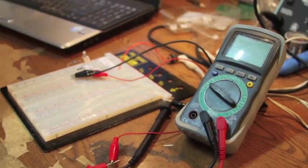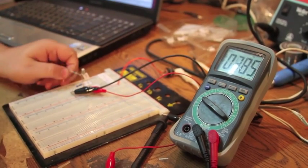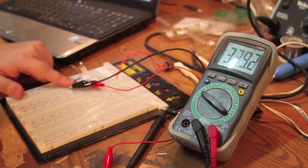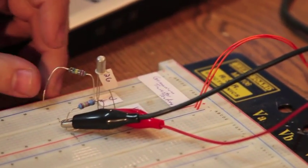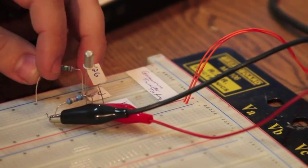As far as your multimeter, the first thing you're going to do is check for leakage. You're going to put it over to volts. Everything's on volts DC, and leakage is just with that base resistor in there, and you pull the collector out. You could also do this with a switch. You could leave it connected and have a switch that was toggled back and forth, if you want to build your own PC board or something like that. But I've just been pulling the lead.